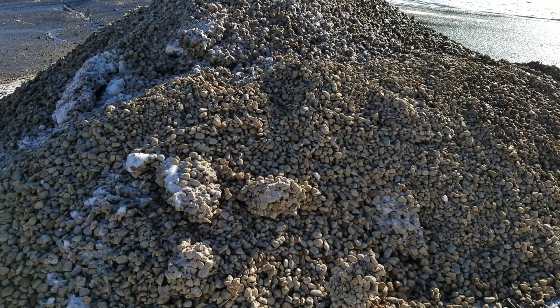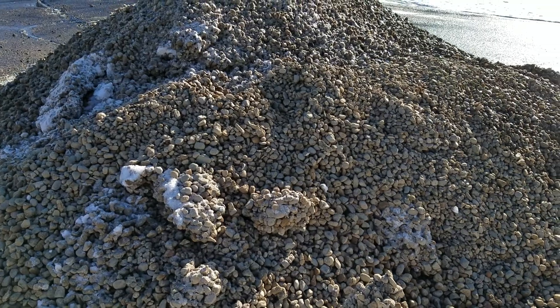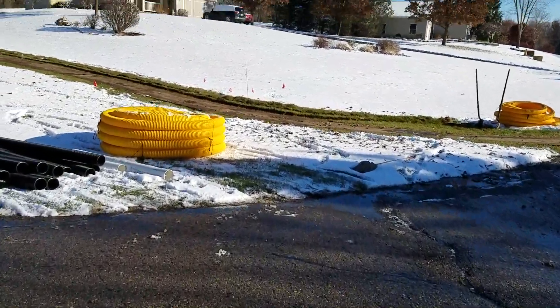When you take that collection area and go ahead and ditch it out and remove the soil, you make a nice wide trench, you fill it in with a really nice drainage stone. That's the key ingredient, and then you want a really good drainage pipe.